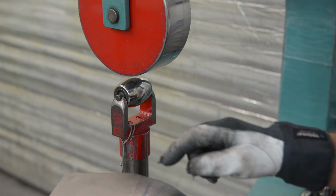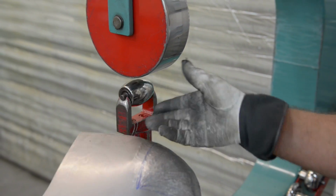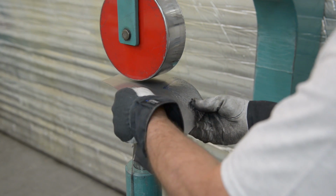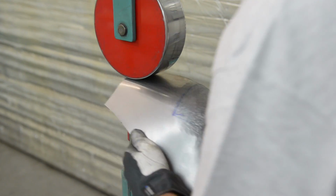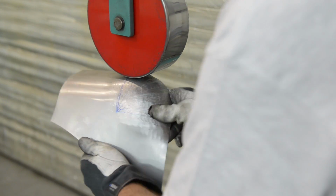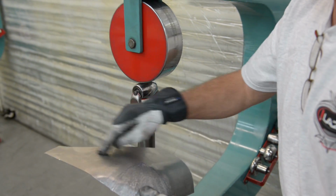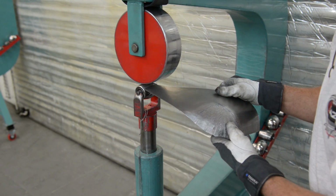So I'm over here at the English wheel, and before I start smoothing this out, I would like to bend this. And I could do that with a rubber band, to put the rubber band on the English wheel, or if I'm bending it over this lower wheel. And in this case, I prefer to roll it and bend it. So I'm pushing down my left hand a little bit. There you can see the result after that. Now I'm going to do this part of it. Then I can smooth this out and maybe go and adjust some shrinking with it.